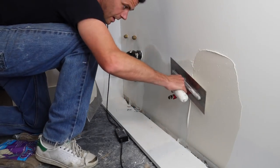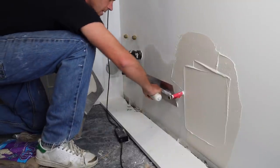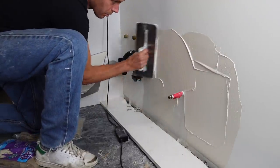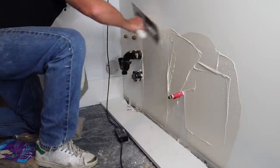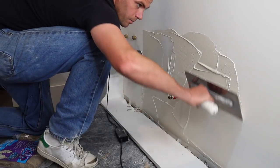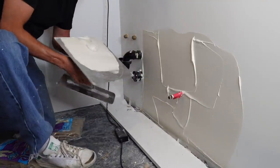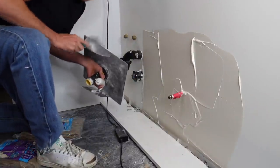So even though I'm saying right now that this kind of does work and you can do it, there are some stipulations. I wouldn't do this with a piece of board that has any of the factory edges, because the backside of the board has all these different laminations of paper where the white paper underlaps or overlaps the brown paper. There are all these spots where the glue could let go and you'd get a delamination where the joins of paper are. So if you did something like cutting a little chunk of a vaulted ceiling wrong and wanted to use the wrong side — well, if it's just a little piece and you don't have any factory edges, you might get away with it, but no guarantees.